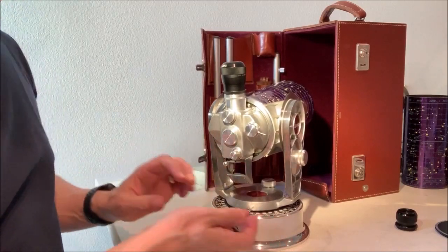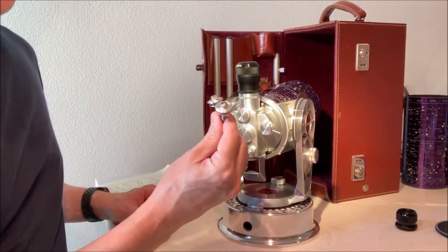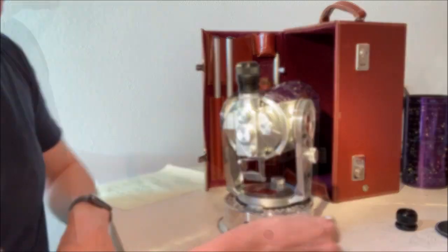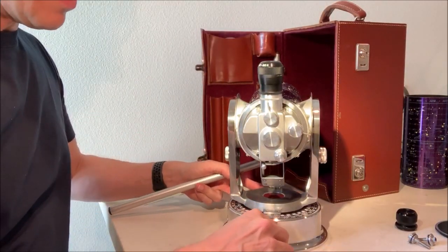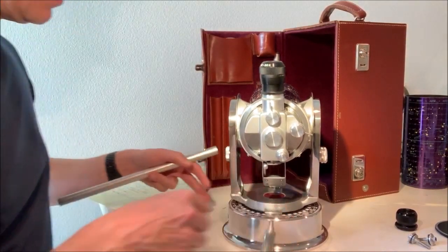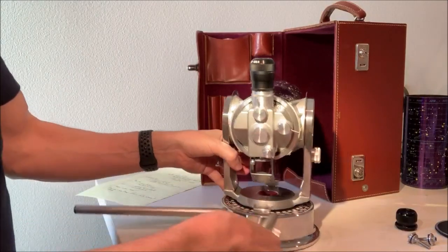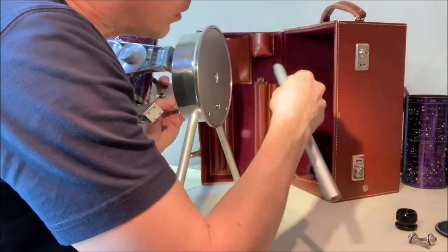These plugs are made differently currently, so these are irreplaceable if they look like this with the screws on them — you don't want to lose them or let them get scratched up, so treat those with care. On these older scopes we have these finely ground legs that slide right in with a very nice, snug fit. The newer ones are threaded in, which is much more practical for manufacturing with less precision required.